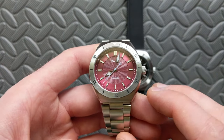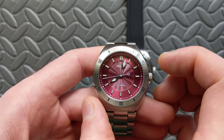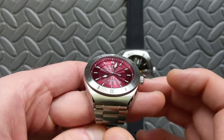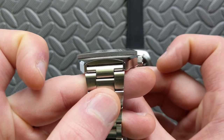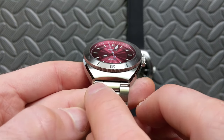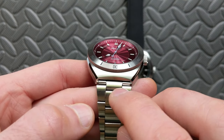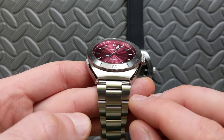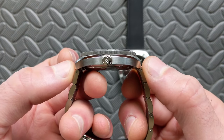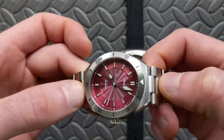Now let's take a deeper dive into the watches themselves, looking at overall specs. First, this is coming with a 40 millimeter case — I validated all measurements with my calipers. The bezel steps down to 38.5 millimeters. The lugs are a standard 20 millimeter, so this is not integrated and will accept various straps. The lug-to-lug is an extremely short 42.6 millimeters, measured at the actual case itself.